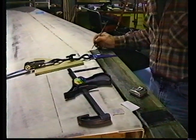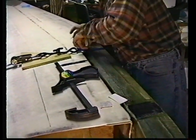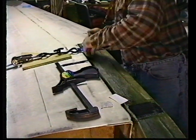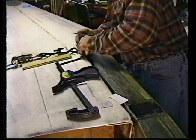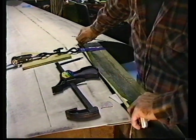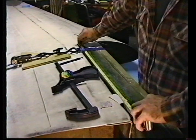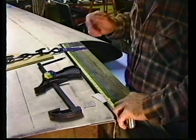You're going to measure from the outboard end of your main spar, and you're going to determine that you are absolutely 2 inches to the center of your hard point. Once you've determined that, you'll measure laterally over from that point, and you'll find it's 29.85 from the one mark. But the actual dimension works out to 28.84 or 28.85, which is fine. That's if you built exactly to plan.